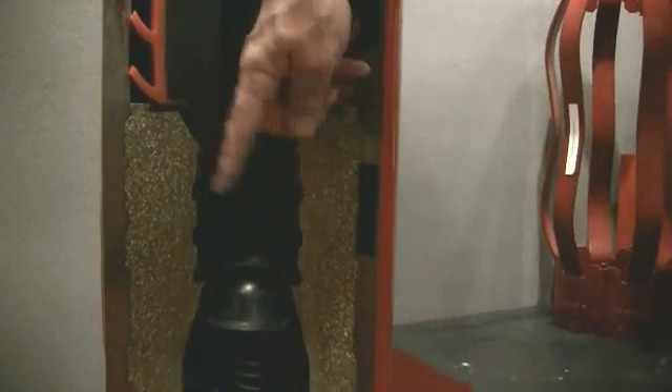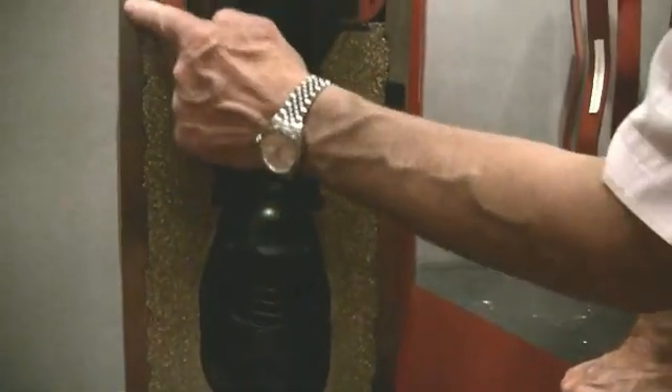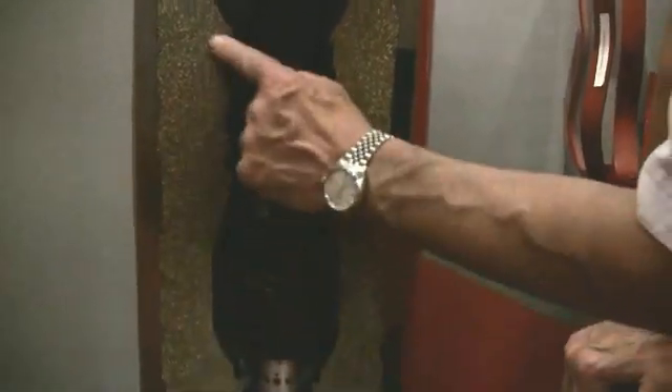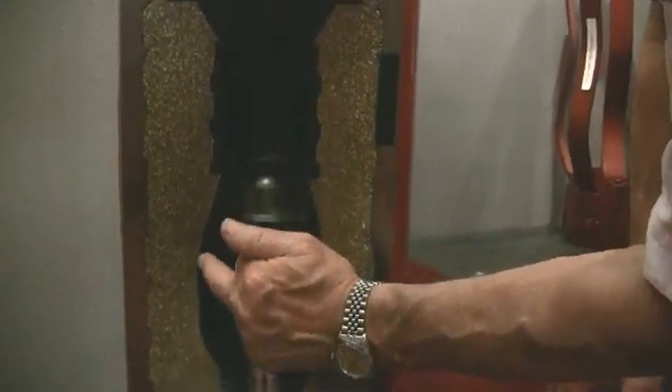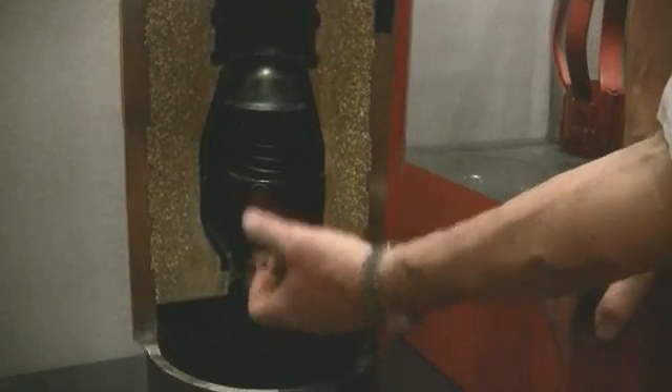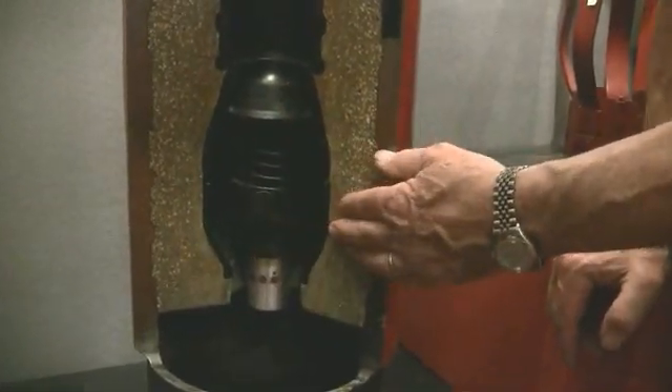Now it's no mistake — if you look carefully, you will notice that this float shoe is made of concrete. The outside is steel, but inside is concrete. These pieces are bakelite and plastic, and the valve itself is bakelite, plastic and aluminium. It's all drillable.